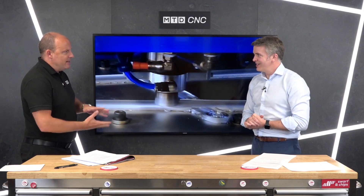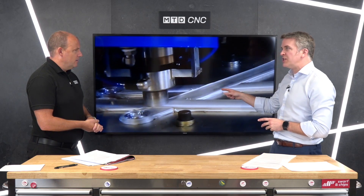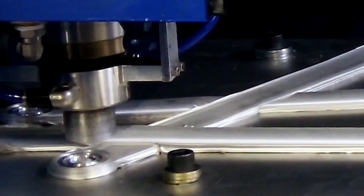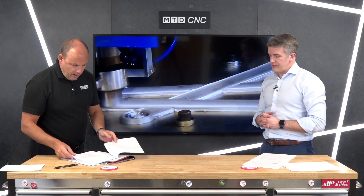What's the depth of the layer? How does it all work? Up to about a millimetre. When you're talking about the deposition rates, we're talking about 10 times faster than standard printing. You can see this — this is aluminium — so it's obviously quite fast and impressive to watch.